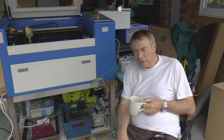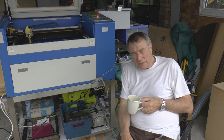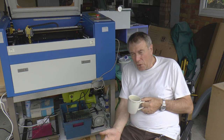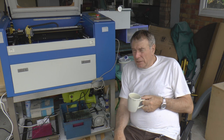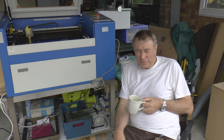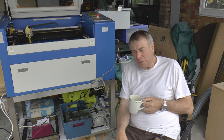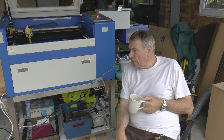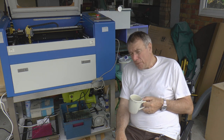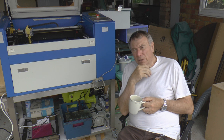Anybody watching this and thinking about buying a machine - the only thing I would say is you're not going to get quite what you expected. If you buy a 50 watt machine, it'll be fitted with an 800mm long 40 watt tube. It'll have a 50 watt power supply, but the tube won't be very good. It'll work for a week, a month, six months - but be prepared to think about the cost of replacing the tube, because either it won't work or you'll be very unhappy with its overall performance.